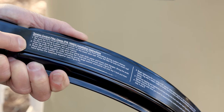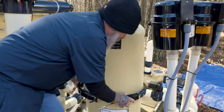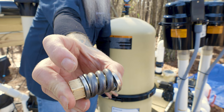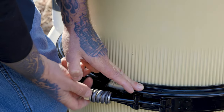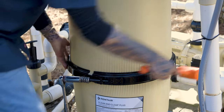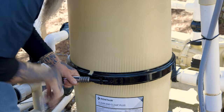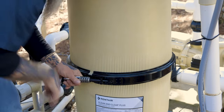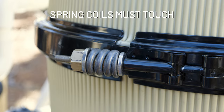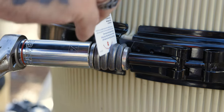The band clamp is an important safety feature of the filter — make sure to read the instructions on the clamp before you reinstall it. Place the band clamp where the two halves of the filter meet and insert the bolt into the sleeve. Take the barrel nut, spring, and washers and assemble them in the order shown, then thread the barrel nut assembly onto the bolt until hand tight. Make sure the clamp is staying on the tank flanges as you tighten. Take the 7/8 socket wrench and further tighten the barrel nut. After several turns, stop tightening and tap around the clamp with the dead blow mallet — this will release tension and allow you to get it properly tightened. Repeat the process as you tighten. The spring and washers may squeak as you tighten; that is expected and okay. It's critical to tighten the nut until the spring coils touch. If you're not sure whether the coils are tight enough, take a card and try to pass it between the coils — the card should not be able to pass through. Do not tighten further after the coils are touching.